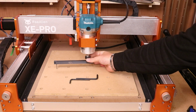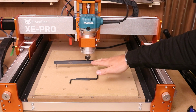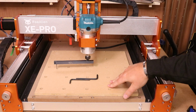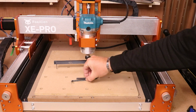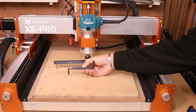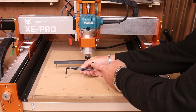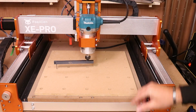Now this just fits into your collet. This is a cheap 3D printed one I designed. I will put links to the files in the description area below. But if you don't have one, don't worry. You can do the same thing with some Allen keys. If you take two Allen keys like this, zip tie them together, you basically get the same shape. That will go into your collet and you end up doing the same thing. Now I'll show you exactly how it works.